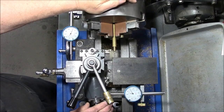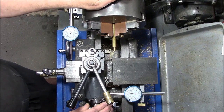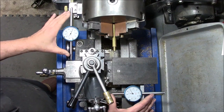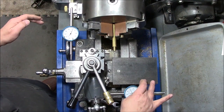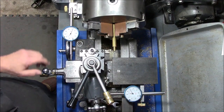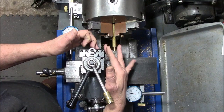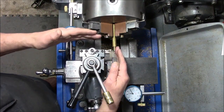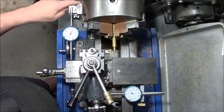We're over at the Atlas 10-inch lathe. If you are a returning subscriber, you've seen this lathe in other videos — I've done quite a few modifications to it. This one is what I call an analog readout. It's nothing more than a pair of two-inch Shars dial indicators with brackets: one attached to the bed, one attached to the cross slide. It gives me the ability to take very fine cuts and move within a four-inch diameter or two-inch radius on the x-axis, and a two-inch travel on the z-axis.